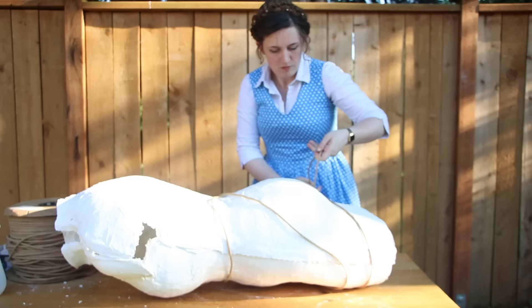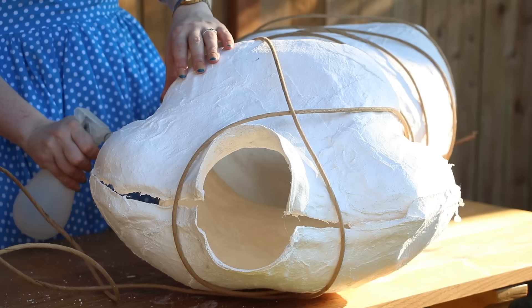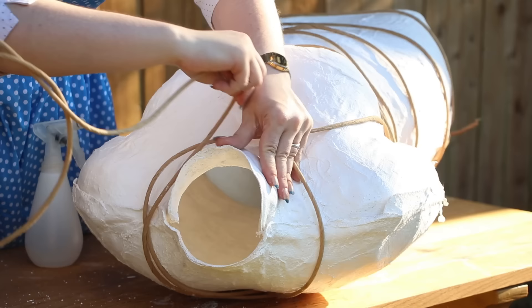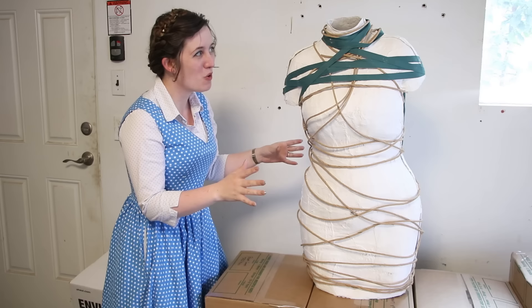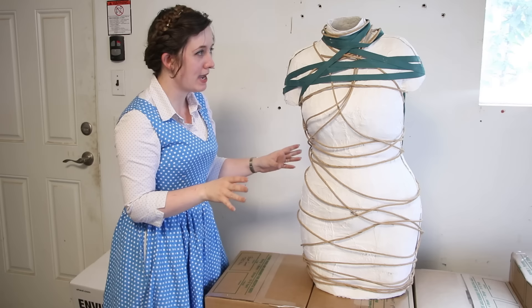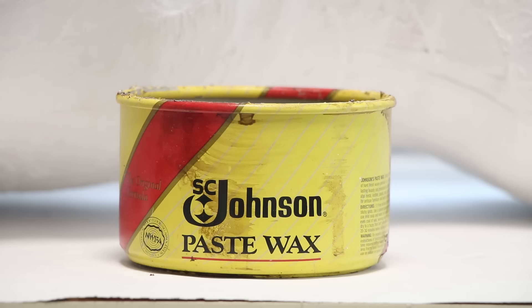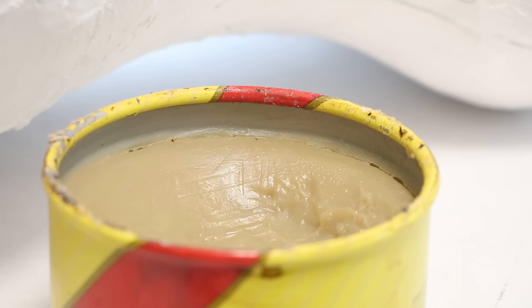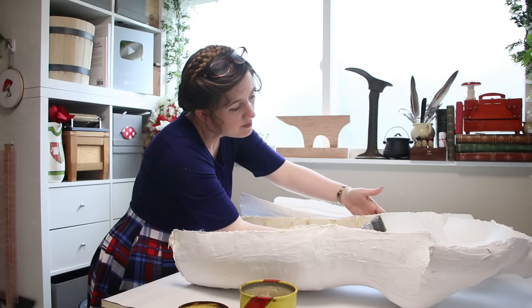I did a bit of patch repair on the inside where it had flaked away, then tied the two halves back together for a final plaster dry period. The top half also gave me some fuss, not really wanting to reconnect after flattening, so I used more water and tied the whole thing together. After successfully re-fixing the mold so all the edges meet up again, I gave it another day or two to dry. With the plaster dry again, we can now seal the mold — I'm using Johnson's Paste Wax to seal the plaster and create a waxy film throughout the inside.